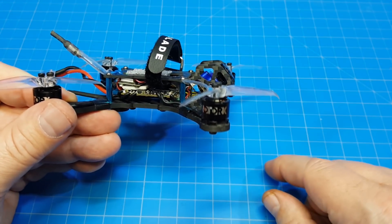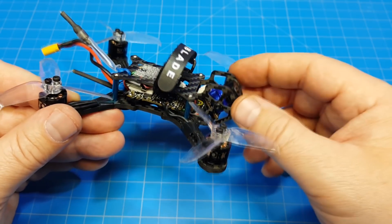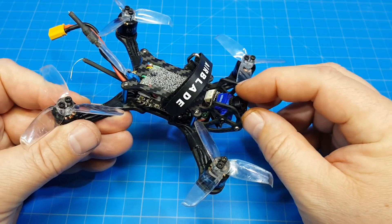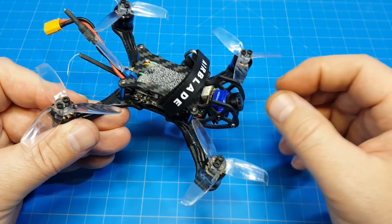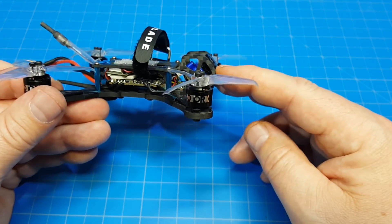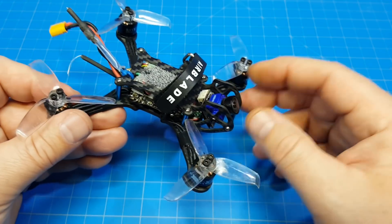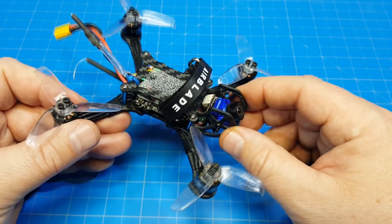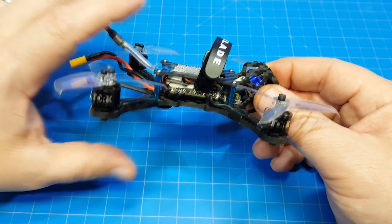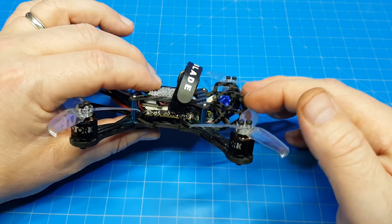The camera is still, with a super wide angle lens, slightly exposed — it noses out just a bit. We could make this a little bit bigger. If you're using a narrow field of view on your lens, you won't see this, and I don't see it in my picture. But of course, if we bump this out just a couple of millimeters to protect that camera a little bit, we might see it, and as a designer you kind of have to take that into consideration — do you risk the camera, or do you do something else?